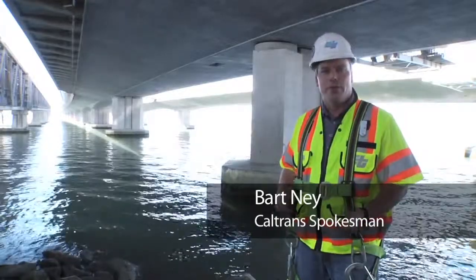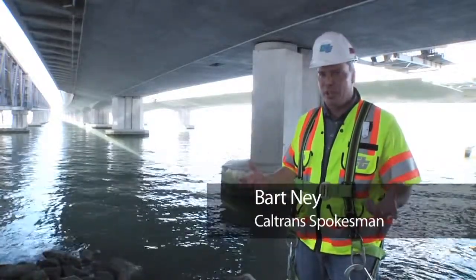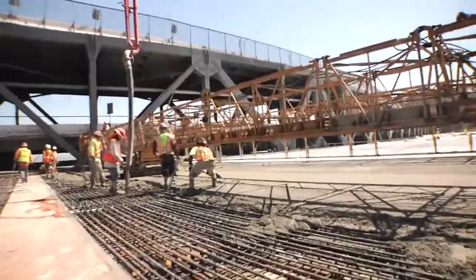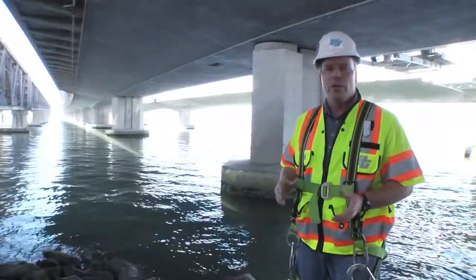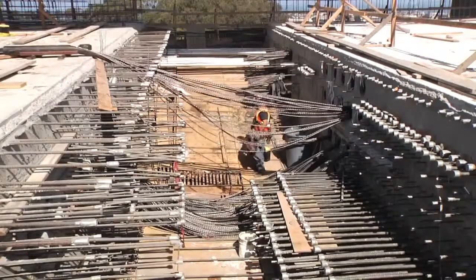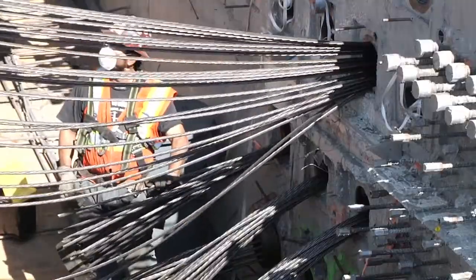I'm Bart Ney, your host, and this is the third in a trilogy of videos where we're looking at constructability challenges for the new Bay Bridge. In the first episode, we looked at concrete placement and how architects deal with challenges in doing massive concrete pours. In the second episode, we looked at steel post-tensioning and how we take post-tensioning ducts and run steel cables through them to give the bridge extra strength and lift.